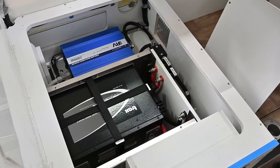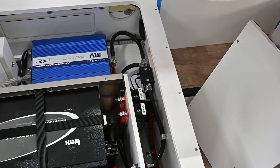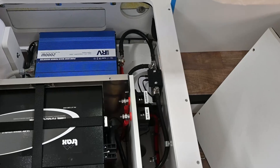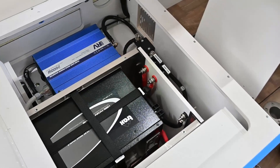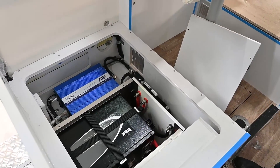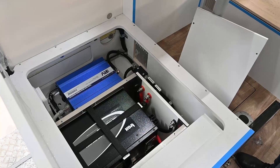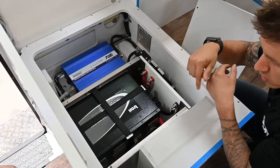You can see the connections on the side of the box as well. Being that we don't want to keep taking the lid off and getting into this box, we actually run connection blocks to the external of the box, where we can then fill on the rest of the components and fuse everything. You'll see that these are nicely labeled so we know which one is which.